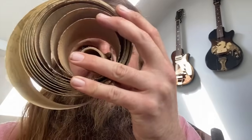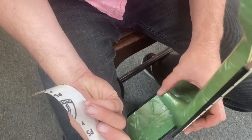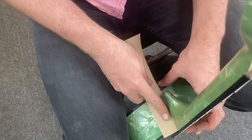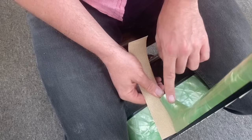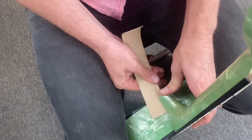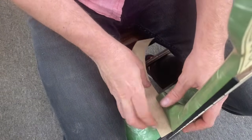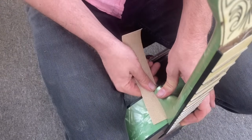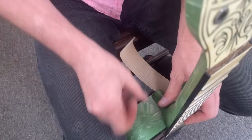It's always good to have motivation to clean, and I did an okay job, but it turns out the 80 grit was just hiding inside of the 220 grit. We've got our PSA 80 grit here. We're gonna slide this in and pull back with our pressure being on the end of the heel here so that we start bringing it down more on this end than that end. And we'll do a few strokes on this side, and then we'll switch over and do a few strokes on this side.